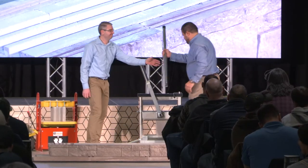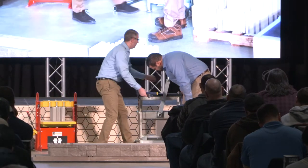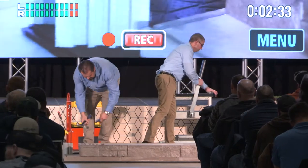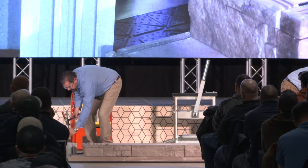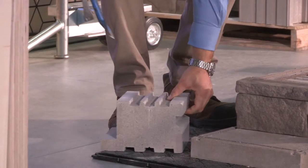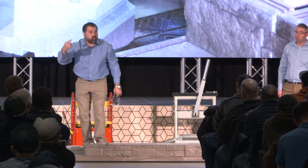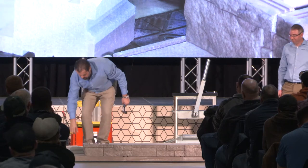The alternative would be — over here — with your safety glasses, with your mason hammer or maul or sledge, go across every unit on all four sides. Not trying to split the block, but to get a good groove all the way around. About the fourth or fifth time it will actually split. So this sucks — get a splitter. It is way easier.